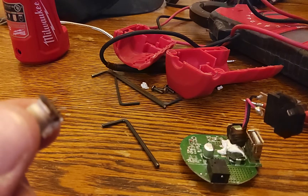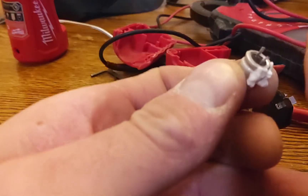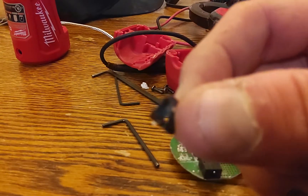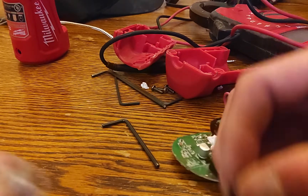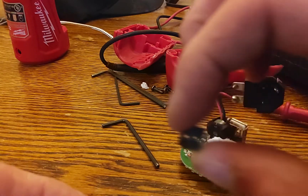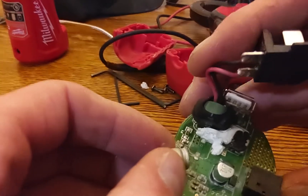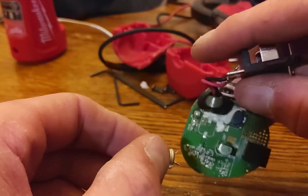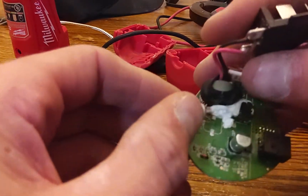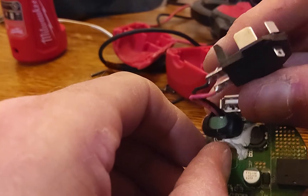Look at that — there's not even a bulge. There's no tin. They put nothing on there, and then this black piece of plastic is their isolator. That's what they're isolating the capacitor with — a little piece of plastic with two dots in it. The tabs were bent flat when I pulled it off, which means it wasn't soldered at all. They just put it on there and then globbed silicone on it.